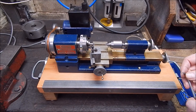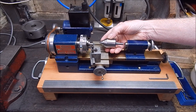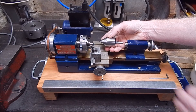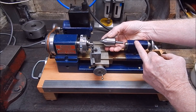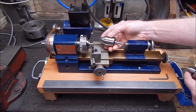For the sake of this video, this worked out very well, and I'll show you how I reduced the Morse 1 down to a Morse 0, for those that are interested. It also shows you how you can cut Morse tapers on your lathe. Small ones like this you can do quite easily with any lathe, but a longer taper you would really need a lathe with either a taper turning attachment or a very long topslide travel, like a toolmaker's lathe, which is basically what I used to do this.